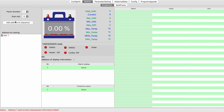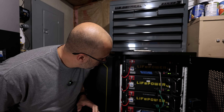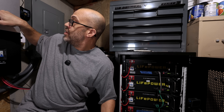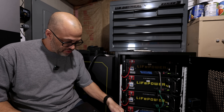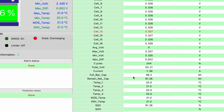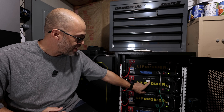Setting address to zero — there we go. The battery is at 91.26%, which matches what my inverter is reading. It says discharging with current flowing. The full battery capacity on this one is 99.2 amp hours, which I've noted on the sticker. I tested this a couple of days ago and I'm just running it again now for the video.